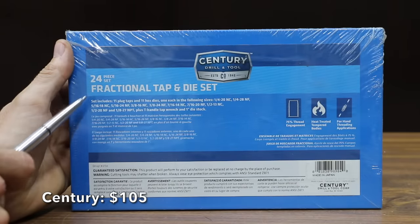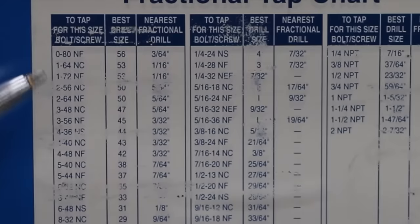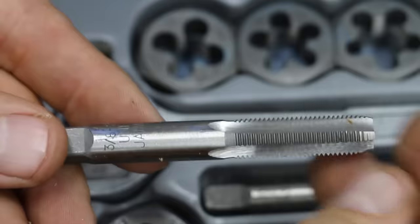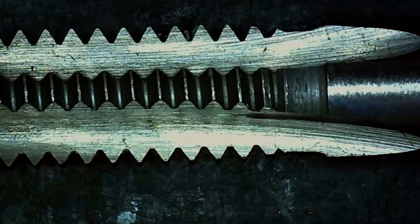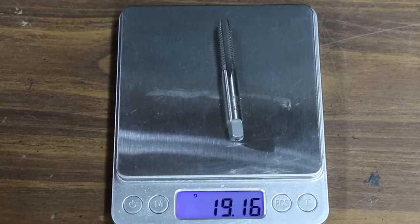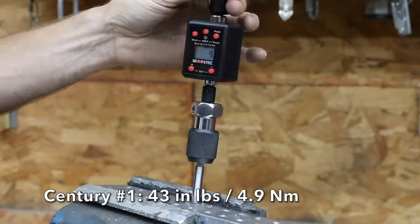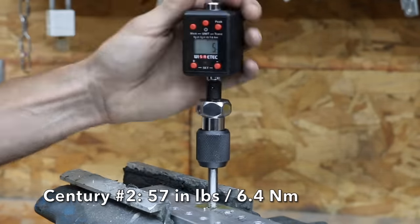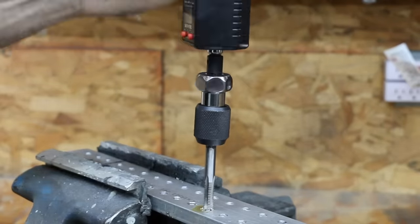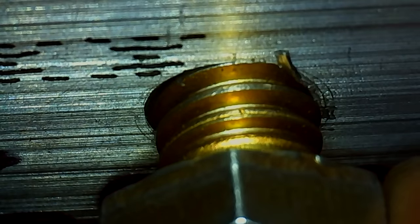At a price of $105 for just 24 pieces is the Sentry Drill and Tool Tap and Die Set. The inside of the case has a helpful chart showing the twist drill size needed for each tap. It is heat-treated and tempered for file-hard threads and longer life; the plug-style tap has 3-5 chamfered threads and 75% thread engagement. The Sentry brand is made in Japan. The tap weighs 19.16 grams and the die weighs 27.57 grams. Driving the Sentry tap through aluminum was nearly effortless at only 43 inch-pounds on the first hole, 57 on the second, and 60 on the third, for an average of 53 inch-pounds—moving into the lead. The Sentry offers a slightly better fit than Pittsburgh and Vermont American, but still more play compared to the Irwin.